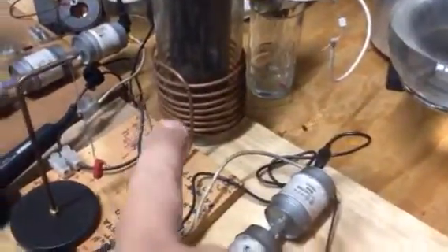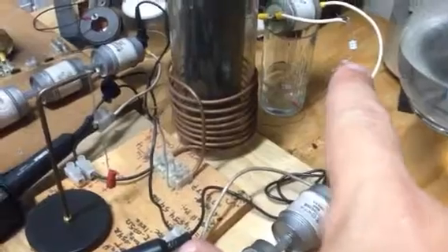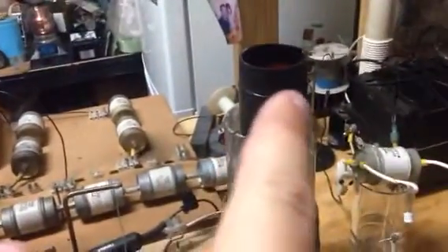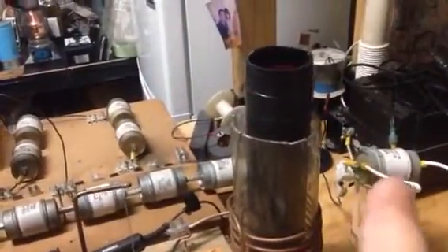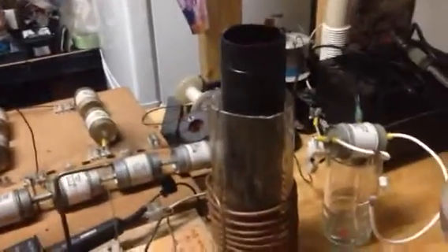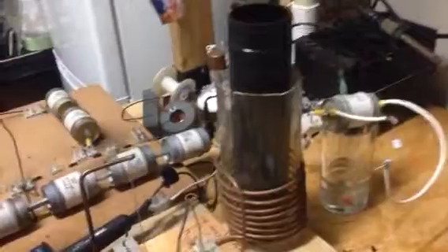This is just going to be a quick video. I'm going to show the output at 200 Hz. It's the spark gap — it's the GDT. This discharges at 3,000 volts. It's got a single lead connected to the top of the secondary over here, and there's a pair of diodes on the other side to separate the charge into the capacitor, so it's DC on the capacitor at that 3,000 volts that then breaks over in that GDT, which is a gas discharge tube.